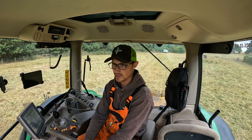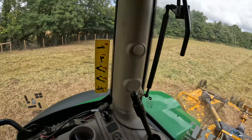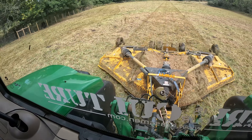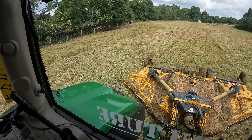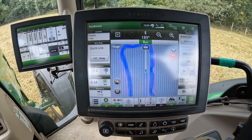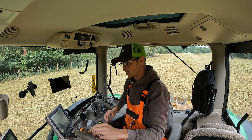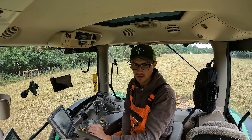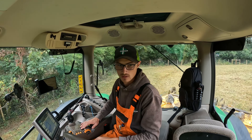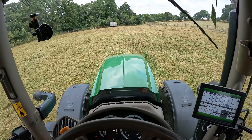We've got so many machines that have power shafts and guards on - we've changed a lot of power shaft guards probably in the last 12 to 18 months. You don't know what you spend on them, they're not cheap, but obviously they're there for a very good reason. There's not much here that really needs topping - you can see there's a few stemmy bits of docks and stuff - it's making a nice job of it. I've just got it set to the very bottom of the chain on the front of the topper, just flicking the ground. I don't really want to be cutting any of the actual grass, just taking off all the stemmy bits. The AB line's working there which is good, saving me having to do straight lines by eye. Soon knock this piece out.